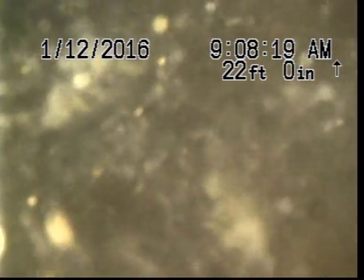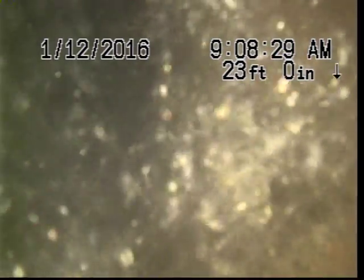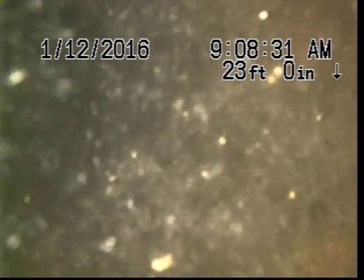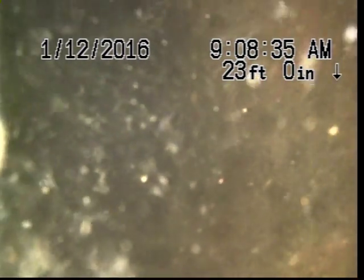All those particles that you see floating around, that's all just waste that's been sitting in there breaking down. But what happens, depending on the toilet paper you use, you start getting into like the Quilted Northern and the Charmin, the 4-ply stuff. That stuff takes weeks to break down, so now you just got this big soggy pile of toilet paper just sitting in the line, stopping everything from flowing past it. All that you see on the bottom is just toilet paper breaking down.